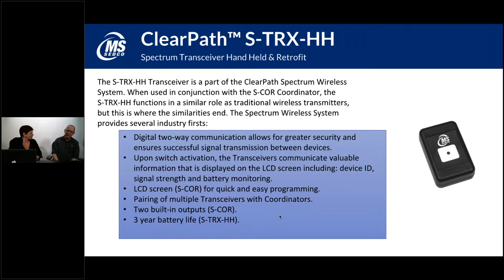The range for reduced mode is just a few feet — five or six feet away. For a longer range, you can pair the handheld as a different type of device, such as an inside switch or an outside switch, and the SCORE will recognize it as a different type of transceiver. The handhelds have the reduced range built into the SCORE programming, but setting it up as an inside or outside switch gives you the full range, which we typically test at over 40 feet. With most automatic doors requiring the button within 12 feet of the door, a 40-foot range is more than enough — and you should still get a signal through energy-efficient glass or other construction.